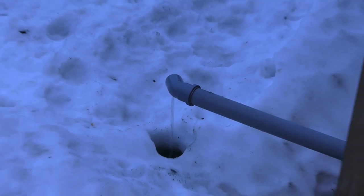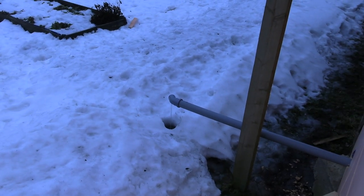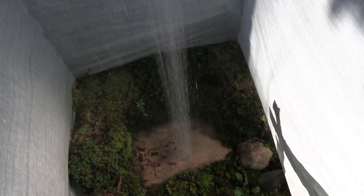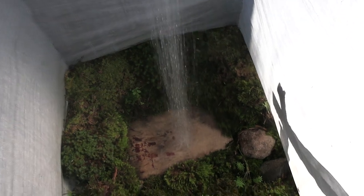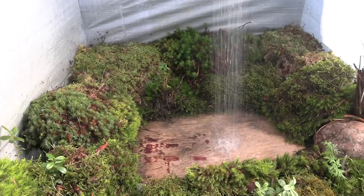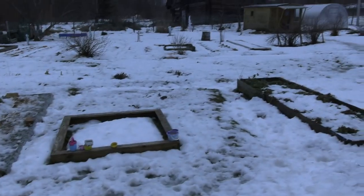11. If you have a couple of hours to spare, you can run a 2-inch, 50 millimeter PVC pipe with a gentle slope of 2 degrees or more that can automatically drain the water to your garden. If it is sloping downwards without up and down kinks, then the water will not freeze, as warm water will always defrost any ice buildup.